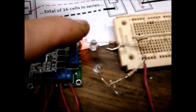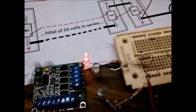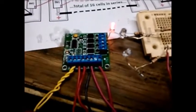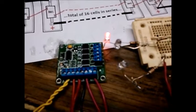These other two are, one is for a buzzer in their picture, and the other they have for the low voltage cutout or the high voltage cutout. They're both the same, because all this thing is really looking for is a break in this terminal. So high voltage, low voltage, whatever, it does the same thing to the input of this headboard, which is to open this loop here.